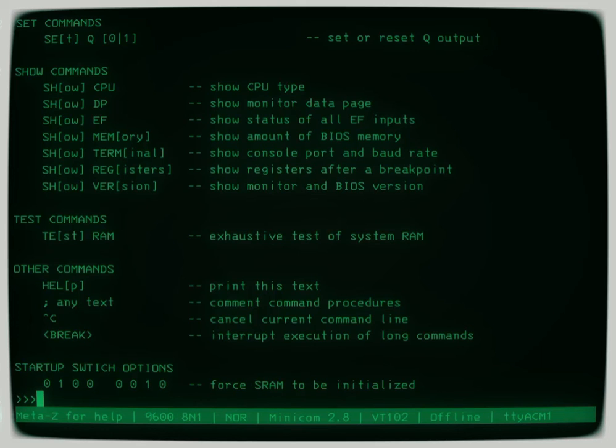There's about half the flash in the processor left. So it would certainly be possible to interface an SD card to it. Oscar has the 1861 emulation code that could be put in here to drive an OLED. I've thought about having banked ROMs where you could at least in the monitor say, well, I want to switch in, for the spare time Gizmos ROM, I want to switch in another ROM or a test ROM. But I haven't done any of those things yet and may not.